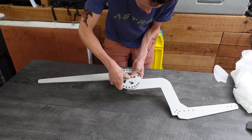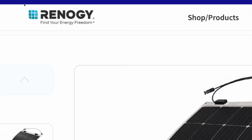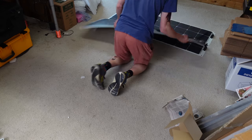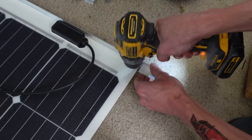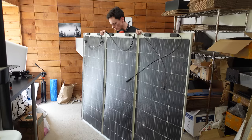They looked great and fit together perfectly. Now time for the solar panels. I'm using six of these 175-watt flexible panels from Renogy. The best part about these is that they're relatively lightweight compared to rigid panels. My plan was to use L-shaped aluminum extrusion to make the frame around the panels that hold them all together. This was relatively straightforward to build — it just required a lot of drilling, sawing — and eventually I ended up with one big floppy solar panel.